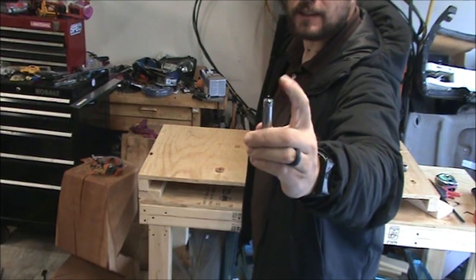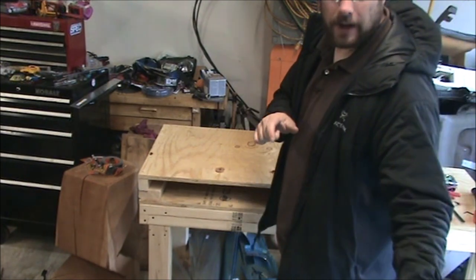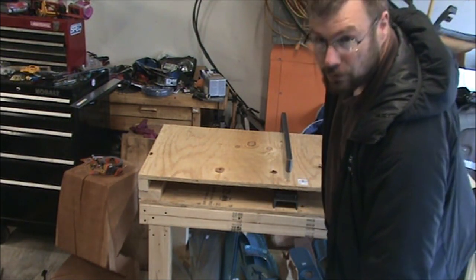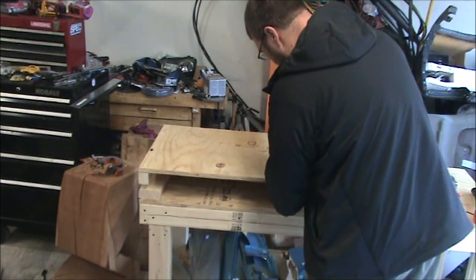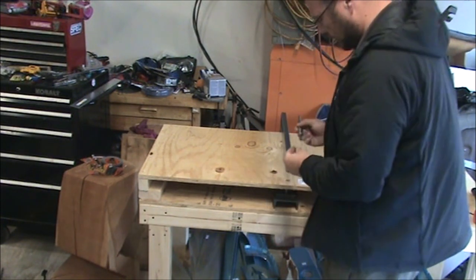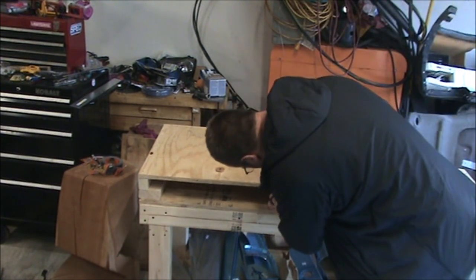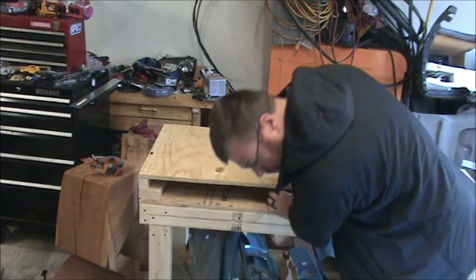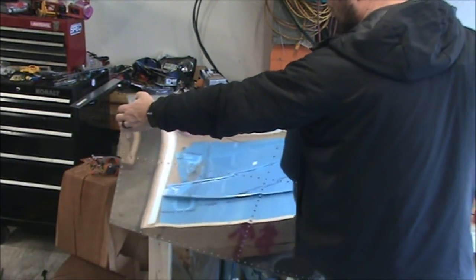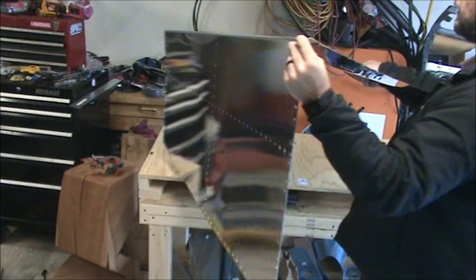Basically, now I'm placing this die on the bottom so I can flip the skin over, outside face down, because the throat isn't deep enough to reach those two holes near the nose. But in this orientation, instead of going in with the skin this way, which isn't long enough, I can go in with the skin this way. And part of the reason I can't just run the skin in there is because of this support. It's too long to put it in there without trying to unbend this nose, or leading edge, too much.